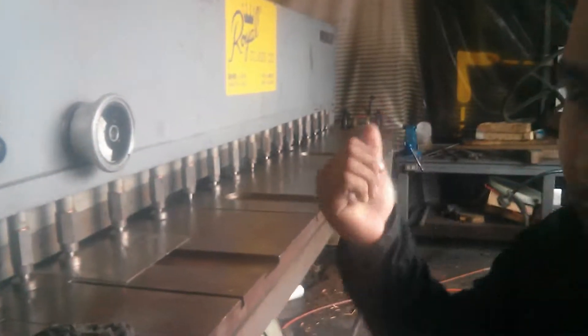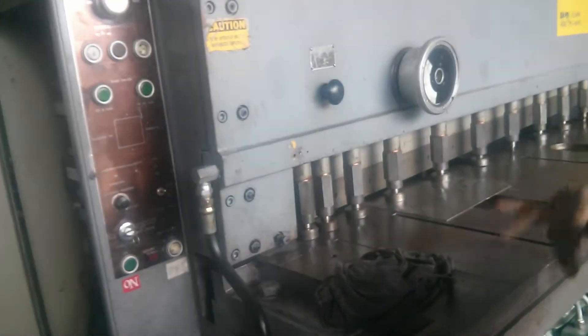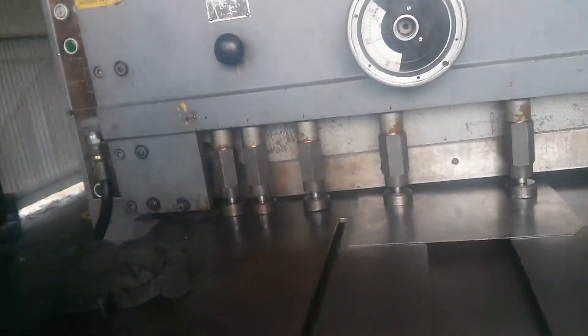So you could basically know that when you cut, you get the right measurement. As you can see here, here's the chain and it has a carrier — a holder that holds the chain up so it won't come down below. Pay attention to that. The machine right now, we have it running, but there's a problem. We drained out all the oil out of the machine. There's air in the system. I'm going to run the machine, retract it up, and basically it's going to go up and do its thing. But when it runs, it's going to start coming down because there's air in the system.